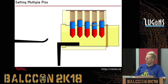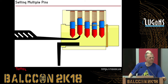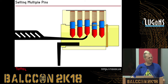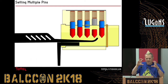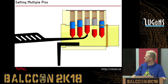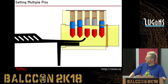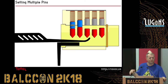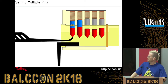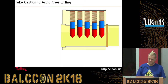The L-shaped thing going in there is called the tension wrench, or torque wrench, and that's what's being used to turn the plug to make the pins bind. The pick being inserted is called a hook pick. The lock picker is feeling those pins one by one to find the one that's sticking. As soon as that one sticks and the plug turns a little bit, a different pin binds. The lock picker finds that one as well, going through them one by one until all the pins are set and the lock will open. You can test a previously set pin — you can feel that the bottom pin is just floppy, there's no spring resistance on it anymore.